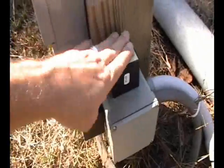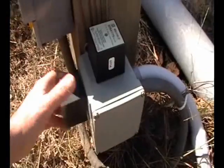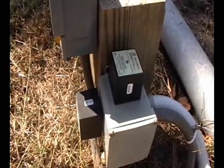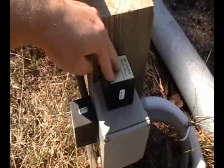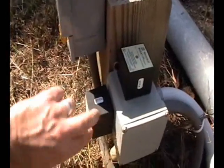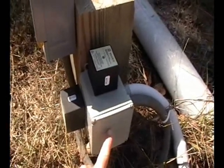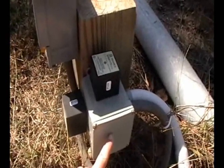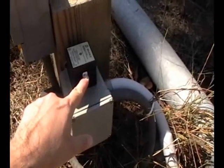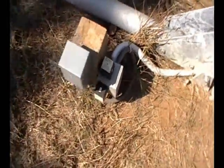In here I have two lightning arresters. Each lightning arrester can only handle two hot wires, so I can do four hot wires total. What I did was double up on one of the power wires coming from the turbine — I took a wire from each one and put it on one hot wire. There's nothing wrong with that.